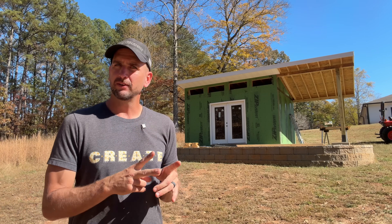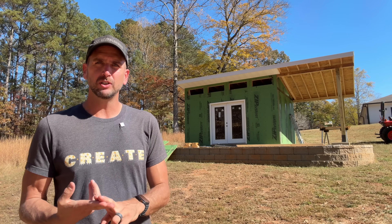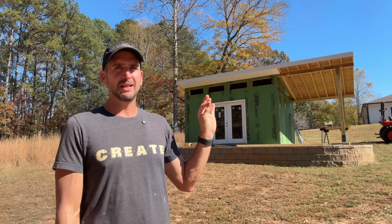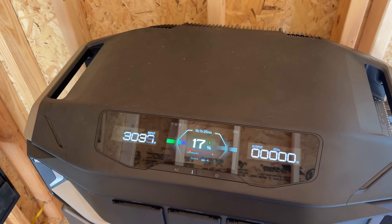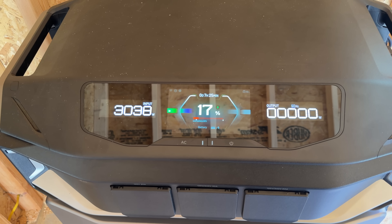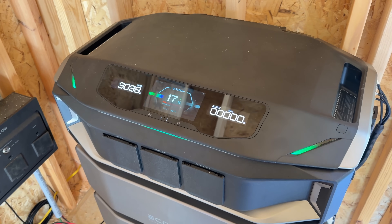Let's take a look at the wiring for the Smart Home Panel 3 — it is recommended to have a licensed electrician install it. But before we do that, let's check how much of the six kilowatts we're bringing in at 10 a.m. from the one solar input on the Delta Pro Ultra X. We have a great day: even at 10 a.m. I'm bringing in 3,000 watts, and we've moved from 0% to 17% battery state of charge, so we'll continue to monitor throughout the day.